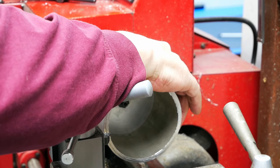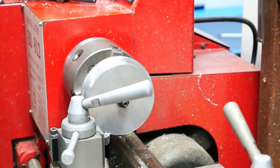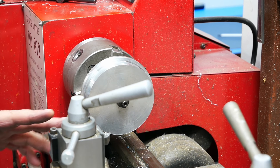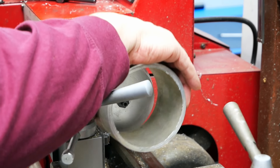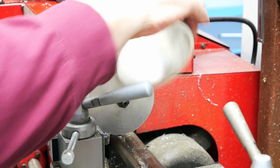I'm going to wait a little bit and let that cool down because the material has expanded from the heat — it's pretty hot. It will shrink a little bit and I don't want the fit to not be snug, so let's wait and then we'll see how it fits.